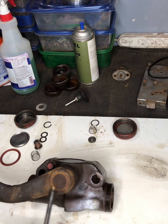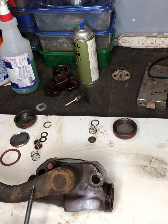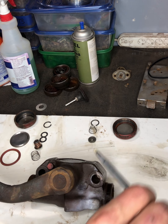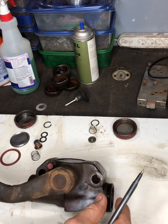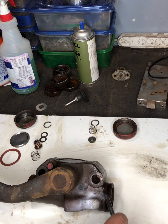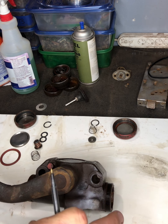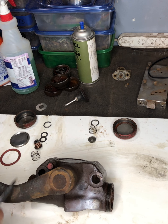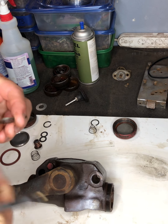When the piston moves back because the axle is returning to neutral position, this lever goes down, the piston moves back, increasing pressure on this side. The fluid in the center tries to move out and passively fills the reservoir on the outside of the piston. On the return stroke, the piston on the return side moves out, increases pressure on the fluid, and that fluid works its way through this relief valve back up into the center reservoir. For minor bumps, fluid will simply shift through those valves causing a damper without the big compression movement.